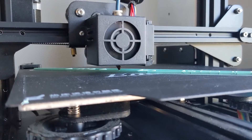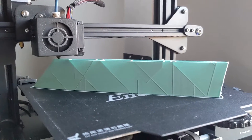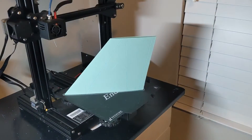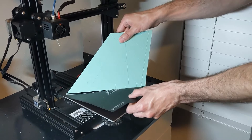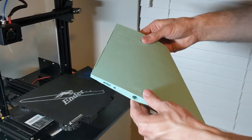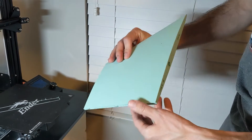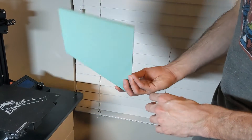These first prints are mostly going to be a test of the overall design and tolerances — will the spar tube and wing screw plates fit into the gaps? Will the spacing I chose for the ribs be enough to support the skin? And will the wing generally be stiff enough? The inboard portion of the wing just finished printing. It feels pretty solid. Let's get the outboard portion of the wing printed and then head to the shop to see how everything fits.